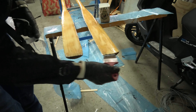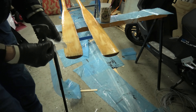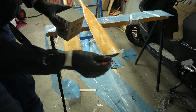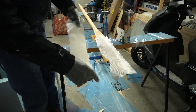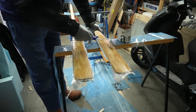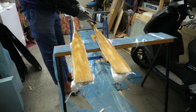Here at the ends I can use the leftover bits of glass. The other side is treated the same way — pre-wetted blades are covered with glass, the air is removed after wetting out, and the rest is covered with epoxy.